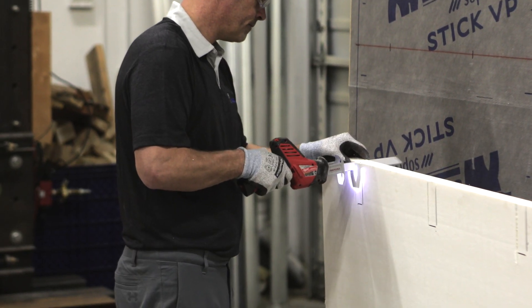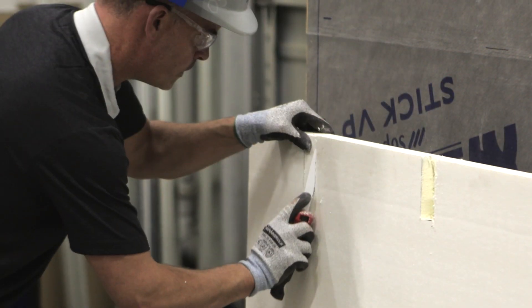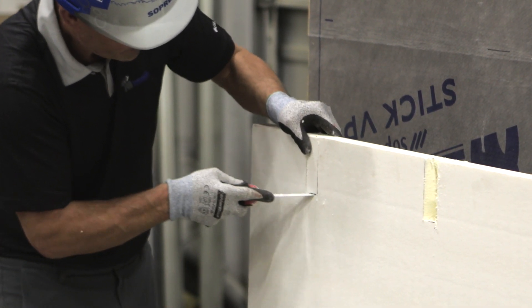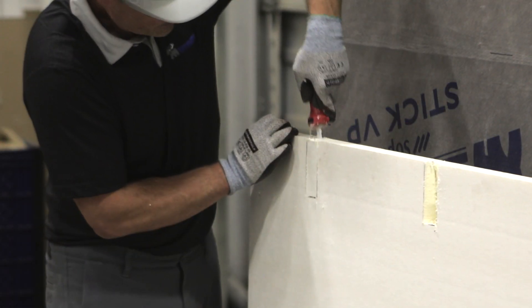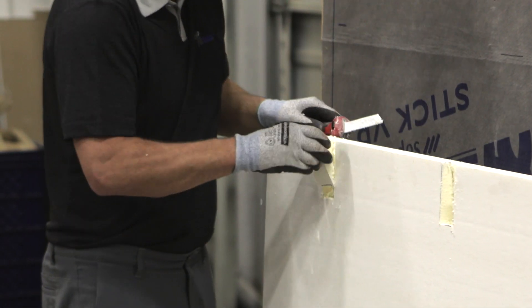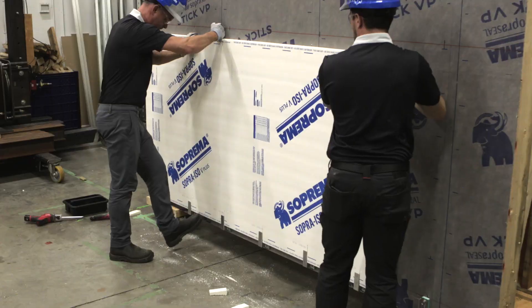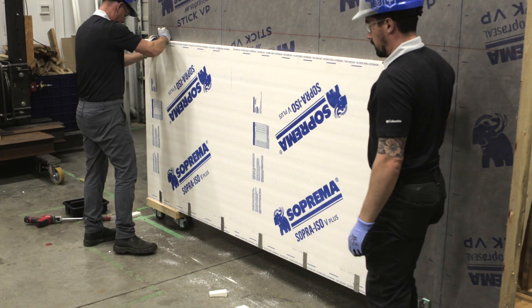The places where you have marked the location of the clips on the edge of the panel must be cut from edge to edge. However, the rectangles are only notches with a thickness equivalent to the thickness of the base of the clips. When your cuts and notches are all completed, the insulation panel can easily slide into position over the clips.